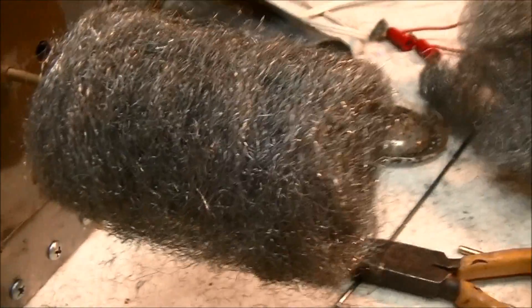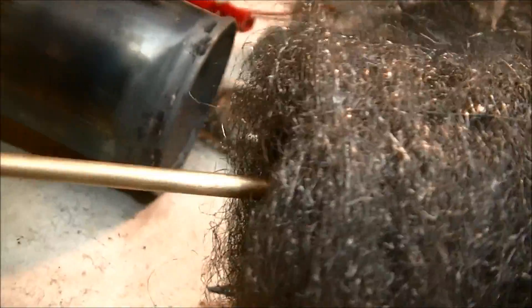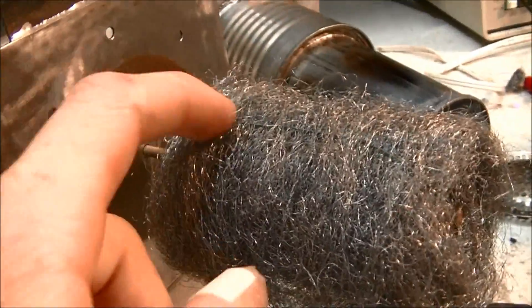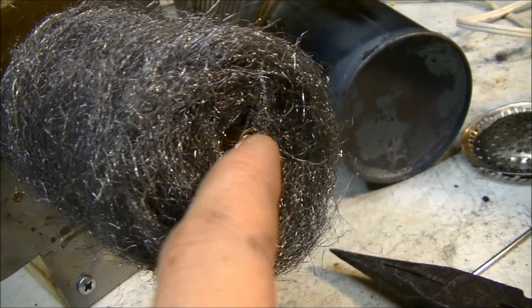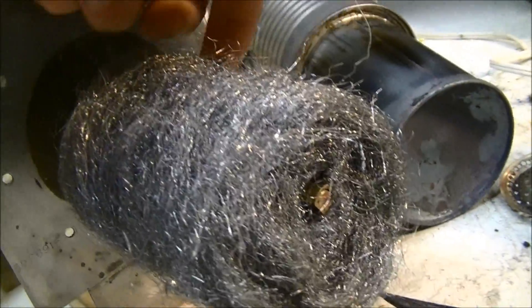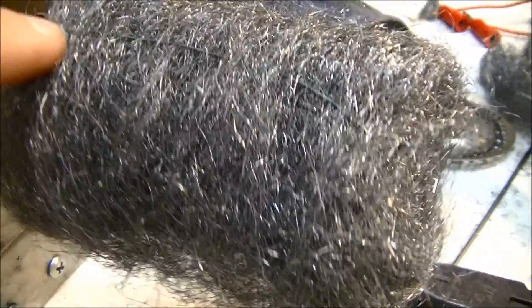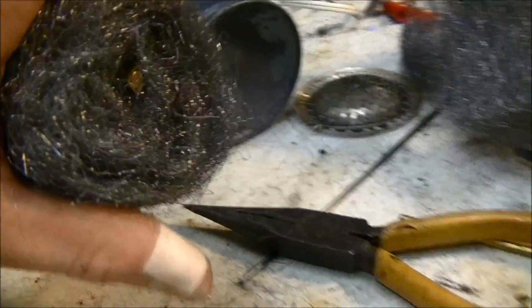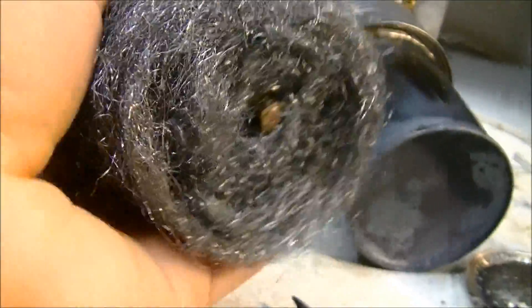Here it is — I think it looks pretty good. I basically took the wire and wrapped it around the shaft or push rod. I started at this end, wrapped it around twice, then looped it over this way and looped it around about one and a quarter turns, then went over to the other side and did it again — another twist around. I did that four times, so I've got four pieces holding it on there. The wire was a little too loose so I took the pliers and twisted the wire to make it a little bit tighter.